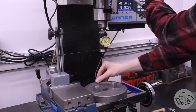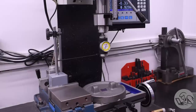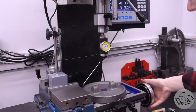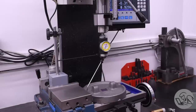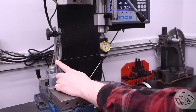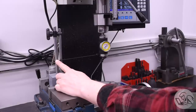I've got my coaxial indicator set up in the spindle and I'm going to use this to find the best center I can. Since the casting is pretty elliptical, I'm not running the coaxial indicator under power — both because it isn't very round and because it's a rough casting with a long indicator arm, which would be hard on the indicator. I'm turning it by hand and four-pointing it: using opposite sides of the casting to get each to read the same value, then doing the same on the other axis 90 degrees apart. That cancels out — or averages out — the out-of-roundness error.